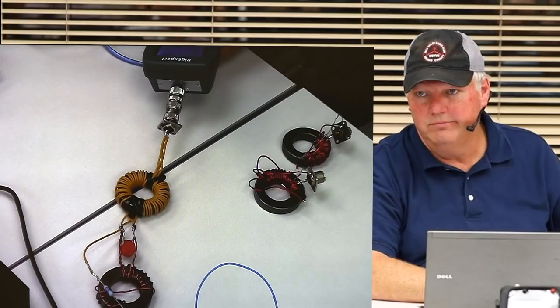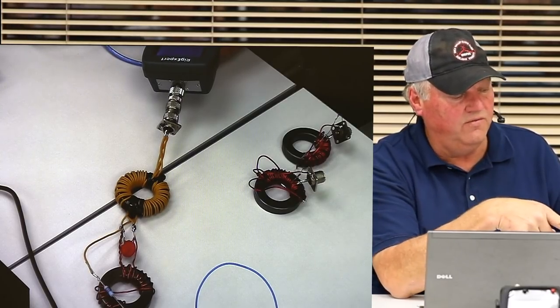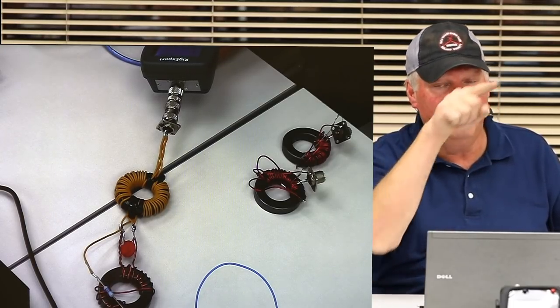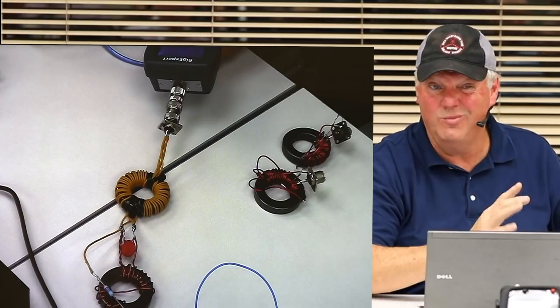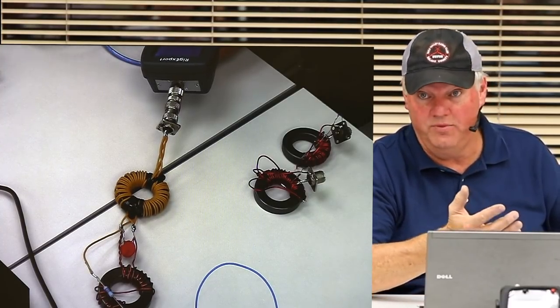It was better. Every time I compared my dipole to this, it was better. Then I took this and I put the feed point up in the air about 35 feet and then ran the other end to a pole that's approximately 30 feet. I could hear better, and people could hear me. The height helped, okay?